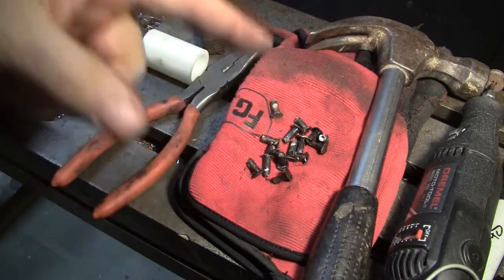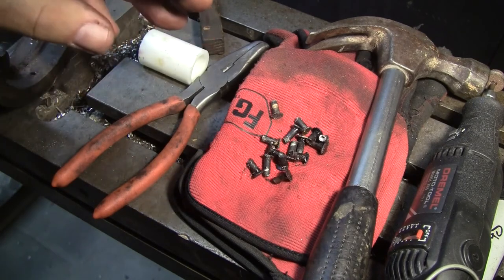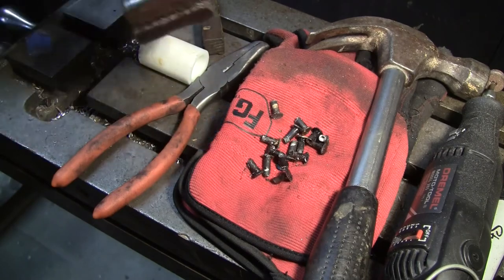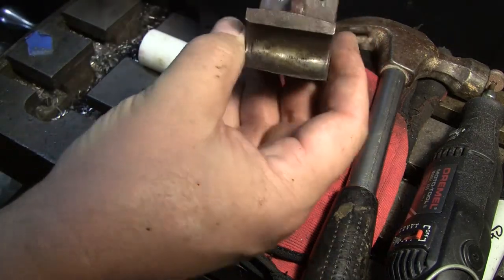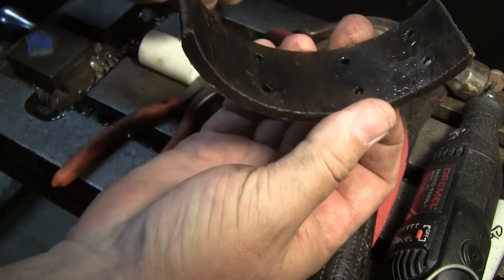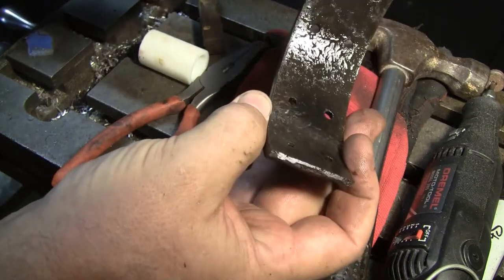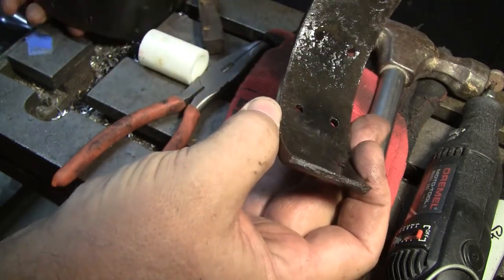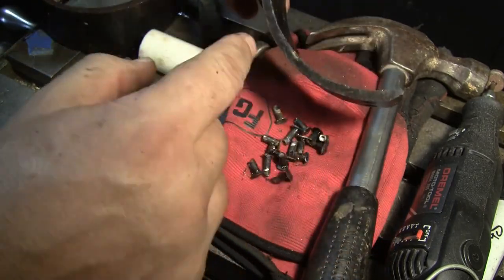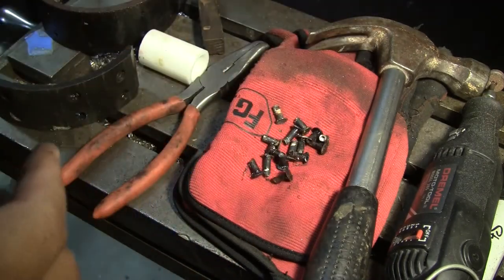Well, there's all the rivets. Since the oil seals leaked a bunch of gearbox fluid, they're soaked and everything. And here's the results. Came out pretty nice. Yep, there we go. And you see all the wetness? Not good. But, you know, that can all be decontaminated. So there's the shoes. Their thickness, you know, there's still a lot of space above the rivet left.